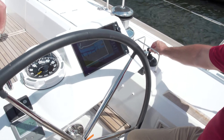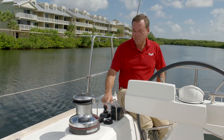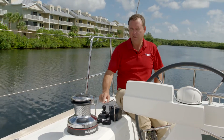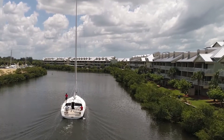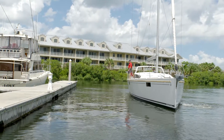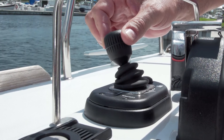Do not pass your arm or other things through that wheel while it's turning. To move forward, simply push the joystick forward. The joystick and the propulsion are proportional, meaning that the more you push forward or rotate the joystick, the more power you apply to the maneuver. Direct sideways movement is the only maneuver that engages the bow thruster. Simply push directly to your left or right.